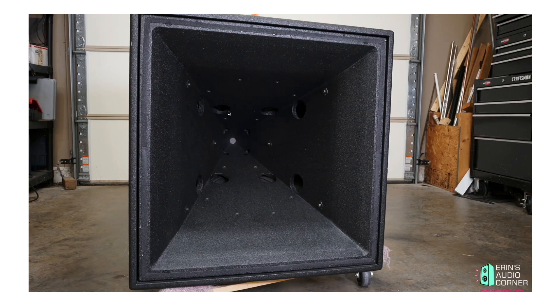The tweeter is located right here. The mid-ranges are located on each side of the speaker, and then the 12-inch woofers are right here and there's one up there. All the data we're about to go through is on my website, linked in the description. I tested just one speaker. I listened to it in my house, used two bands of EQ to knock down a couple frequencies around 1 kHz and 250 Hz, and I was good to go. This speaker is passive and it's expected that you'll use some equalization.